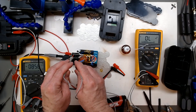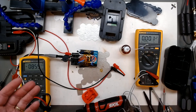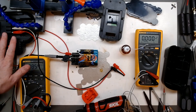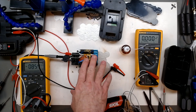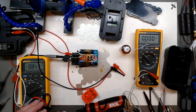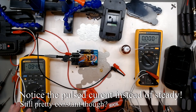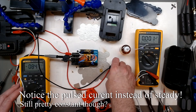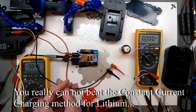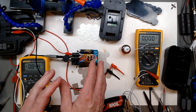It's actually climbing slowly. I just want to do this as a test cycle to see if it answers some questions. Typically I would not use the NiCad charger for this because it's not designed for it. With the BMS protecting it, if it did over-volt I think it would shut down. I am monitoring just to make sure. The difference is the way the NiCad charges from the battery is different, so I really recommend putting a straight 20 volts at about 1 amp constant current charge on the pins and charging that way.